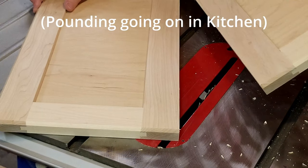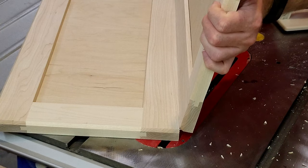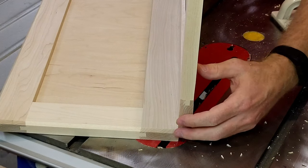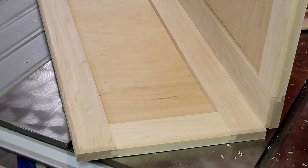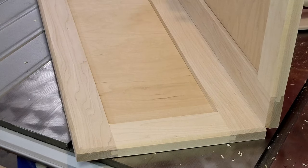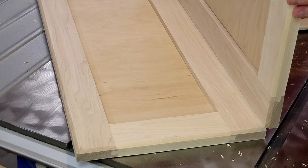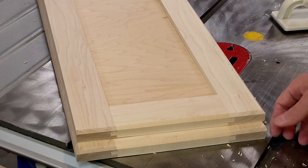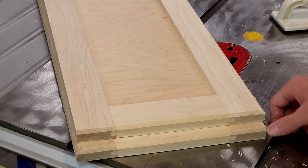I've routed my three edges, and now when the doors go together — overlapping them just slightly — it'll look pretty much just like that. It'll have a nice clean close here, a decorative end here and here, as well as the other three sides. That's how you'd do a corner cabinet door pair. I went really slow when I got down to the end so it only creates little feathers or hairs sticking out as opposed to chipping out.